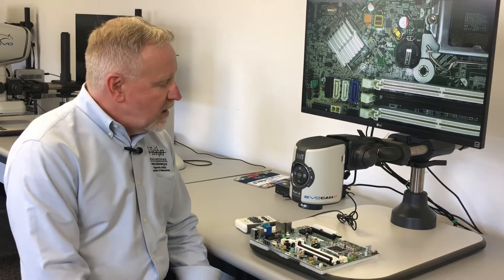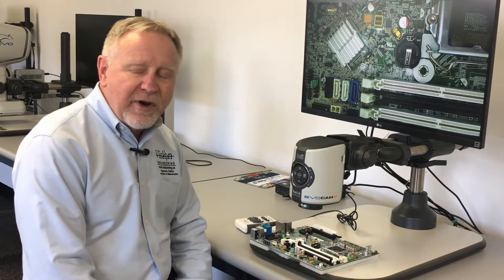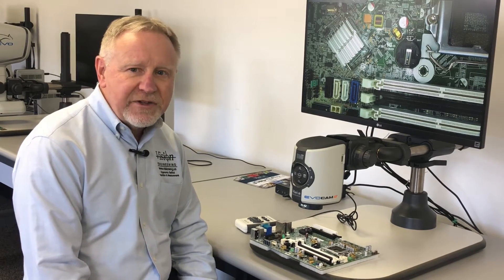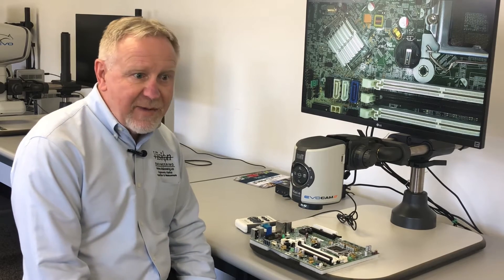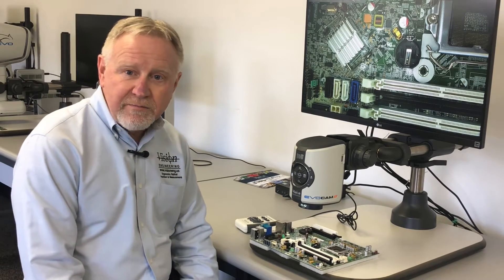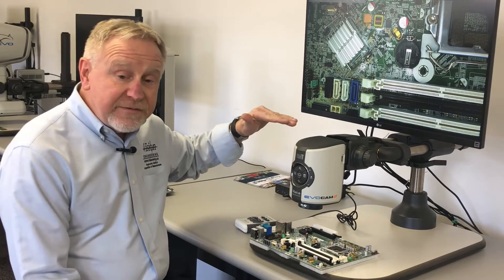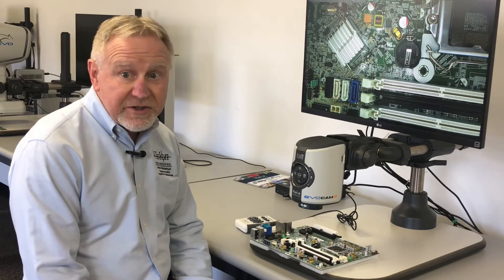The system has a number of objective lenses available. The 0.62 which we're looking at here is the bread-and-butter lens for most people — it gives the most usable magnification range and great working distance. We do have higher-end objectives to achieve magnification in the more than 100 times range, and we have lower magnification objectives to give greater working distances in excess of 10 inches, with field of views that are over 11 inches.